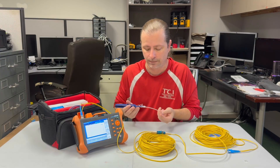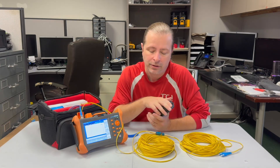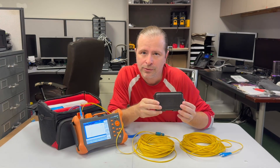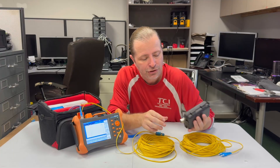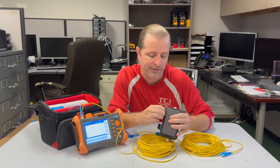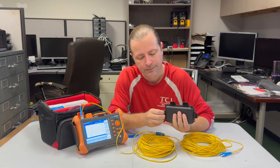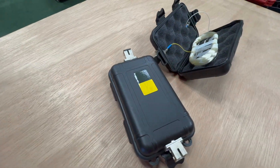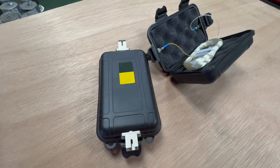For dirty connectors, take out your cleaner. Anywhere you've got a coupler and you think it might be the issue, your first order of business is always to clean the connectors on all four ends and try again. If that's not solving the issue, you're going to snip it and redo the ends, and maybe even splice them physically directly to each other versus using a coupler at all. Now if you need more resolution than that, you might want to use a launch cable. A launch cable usually comes in a small container like this.